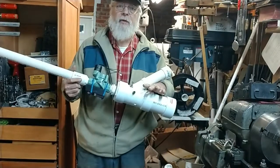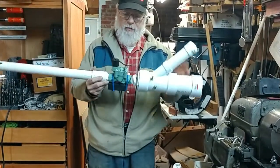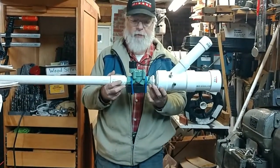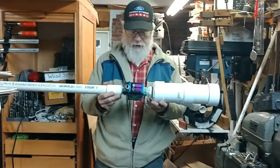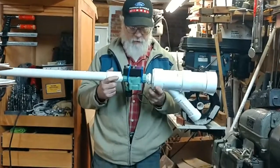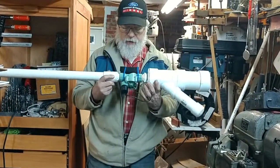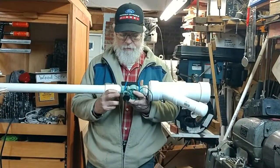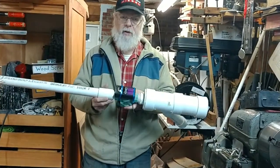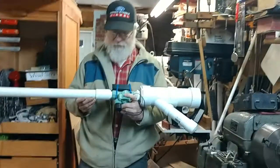We use a simple air compressor to about 125 pounds. The green item here is a Rainbird valve. It's what's used for lawn sprinklers. It's a diaphragm activated valve, 1-inch pipe. So it handles pretty good volume, and this one is triggered with a little solenoid. It's a 24-volt solenoid. We use two 9-volt batteries and a switch, and it fires it.